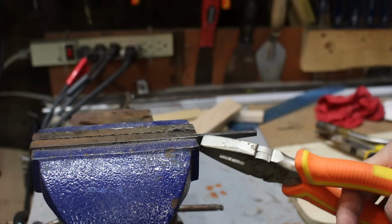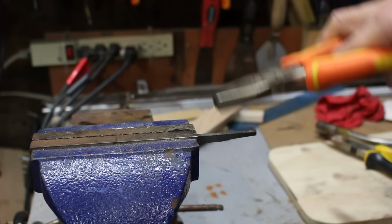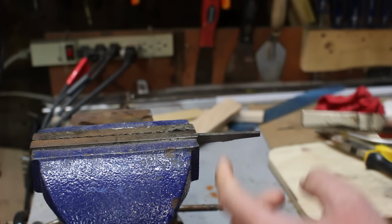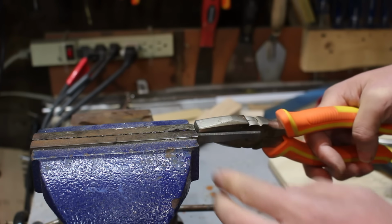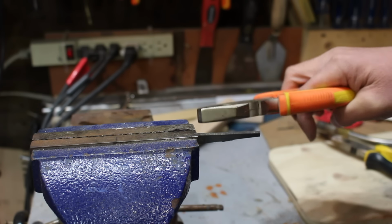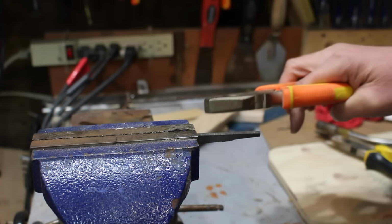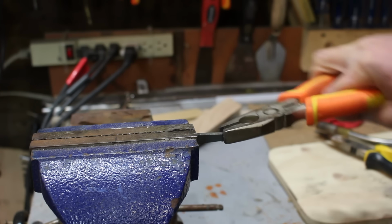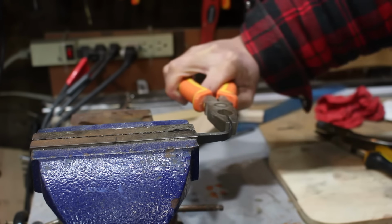And then this piece up here, where it actually kind of got tempered, has become springy now, depending on how you temper the steel after heat treating, because this part up here originally I had heated and then snapped off. But because I had heated up to about here, this here didn't get up to the point where, I forget the terminology of the crystallization of the steel, but it hasn't fully converted to the material, the substance, is it martensite? I forget exactly. Anyways, if you Wikipedia, it's in there. So it's remained springy here. So I can't really bend it, but it's not snapping. So you consider that spring steel or tempered. But this part here is fully malleable.